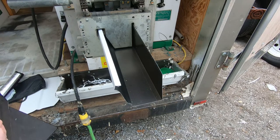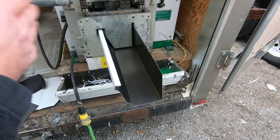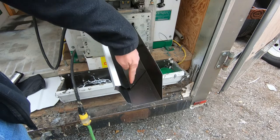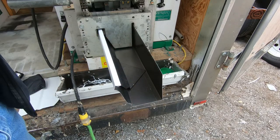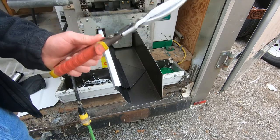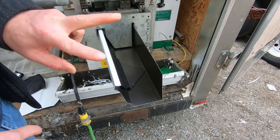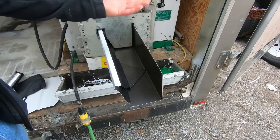There's another kind of cut though. Your home chances are has curves around the corners — inside corners and outside corners. The way we make the gutter work there is we put a template inside the gutter, mark it, and then use snips like these to cut the gutter into the right shape. There are two kinds: insides and outsides. It's very simple but it works great and makes your gutters as seamless as possible.